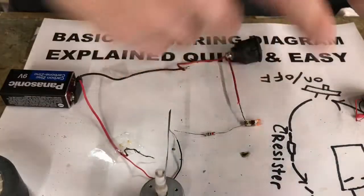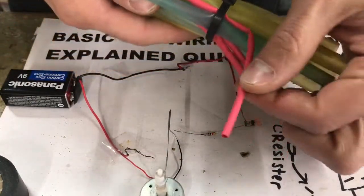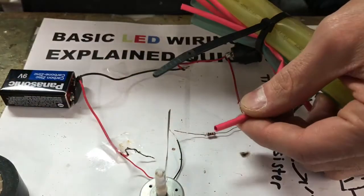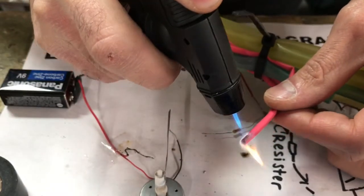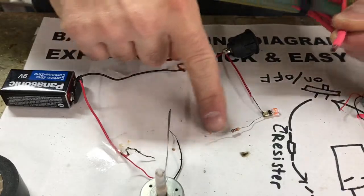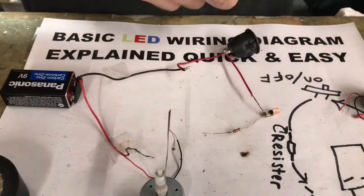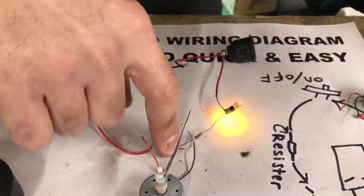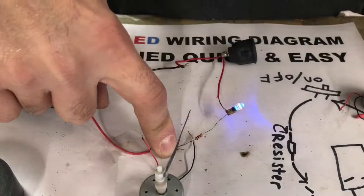Because if positive and negative touch, it's not going to work. Also, there is a product called shrink tube — it's a tiny little tube and you slide this on beforehand, then you take a torch lighter or a regular lighter and it just shrinks the tube onto the wire. That's a real nice product if you want to get all professional and technical. I hope this video helps you guys out on wiring up LED lights. Thanks for watching — give me a thumbs up if this helped you out.